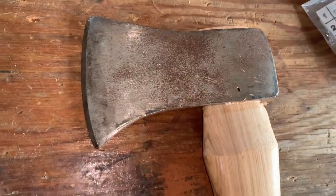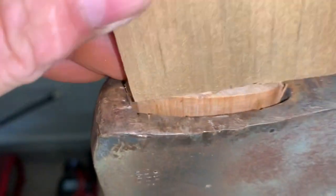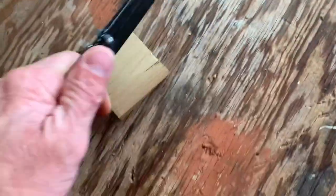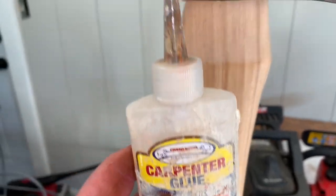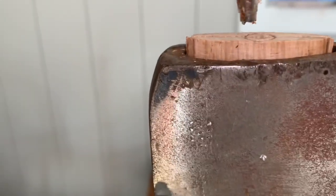That's about right where I want it. Now I'll go ahead and take out my wood wedges and pound them in there. I'm going to have to trim this up a little bit because it's too wide, so I'll just cut it right there. I marked it about where I want to cut it — I can snap that right off. I just took my hammer and gave it a whack on the edge of my knife. What I'm going to do is put this old carpenter's wood glue down in here before I put that wooden wedge in.